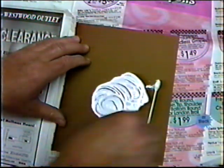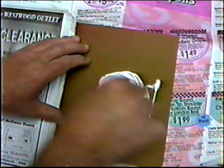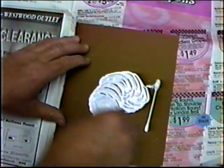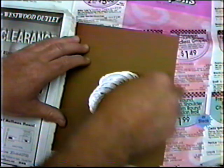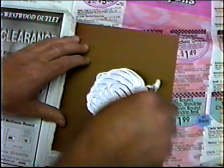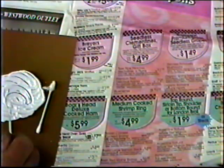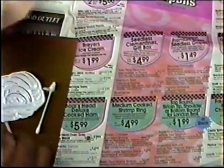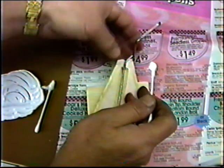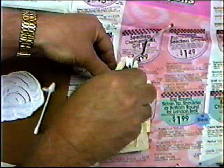And all this is going to do is, as soon as this starts to go to cheese, I'm going to use this to seal in the mold. Seal where the wire goes through on both ends. And this is just ordinary 5-minute epoxy. And you can see right up here is where it's going to need to be sealed. This will all get carved off later. This just makes a little dam of sorts.